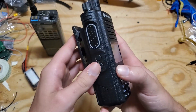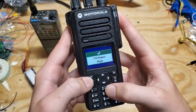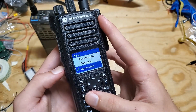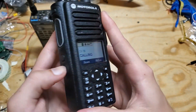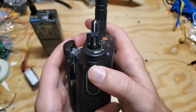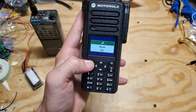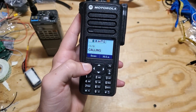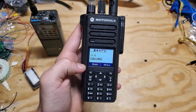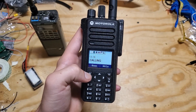There are plenty of multi-function buttons. The P1 and P2 buttons I have programmed for TX power level and scan mode. On the side I have a button programmed for zone selection and the dotted button for open squelch. There are also two more buttons I haven't programmed yet. When you put the radio into scan mode it scans all channels with just a little zigzag arrow on the screen as indication — it scans through all 16 channels in under a second.